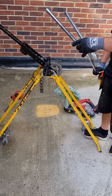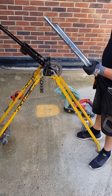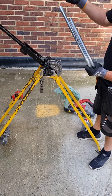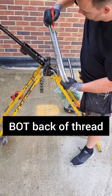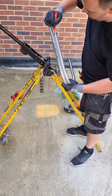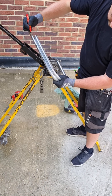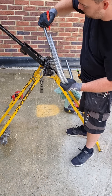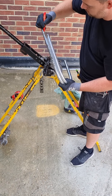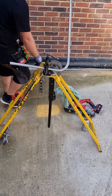Now, say you wanted to do these two pieces of conduit exactly the same. This is the back of the thread method, the B.O.T. So instead of marking here, I'm threading back — taking it off, threading more or less. We're going to line them up, mark where the end of the thread is, and then we're going to cut here and thread back. That's all.